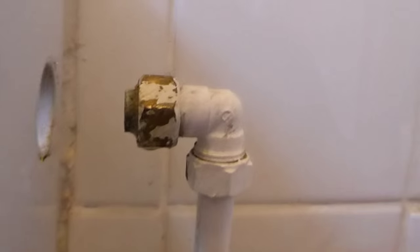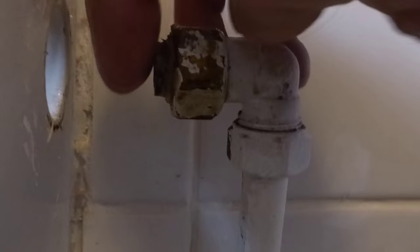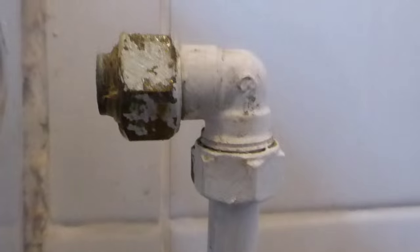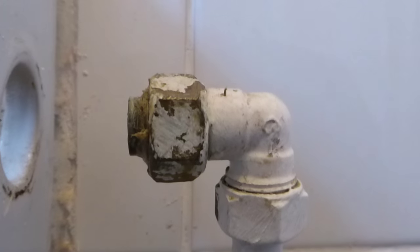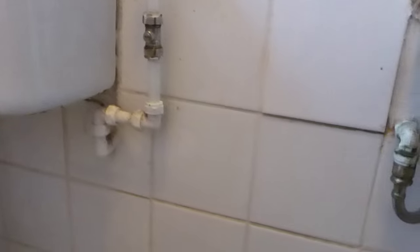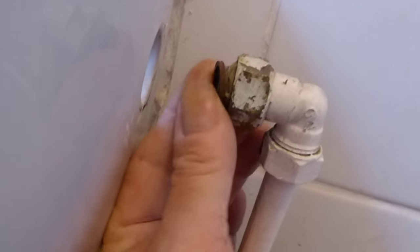Before we insert it into the system, have a look at this joint here — there's no ring on there. There should be a little fiber washer on there. If you haven't got a fiber washer and you've got a bit of hemp or PTFE tape, it will do — you can wrap it around and that will make the joint. But there are proper fiber washers to go on here. I'm going to whip this remaining piece of washer off. I've got a bit of hemp to use, but a fiber washer is the order of the day normally. My fiber washer doesn't fit on this old imperial fitting — it will fit on most normal ones — so I'm actually forced to use a bit of PTFE or in my instance a little bit of hemp. That is the normal washer you'd get to go on your swivel joint if it was a bit newer.